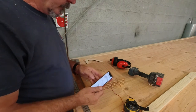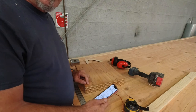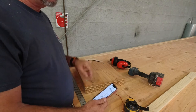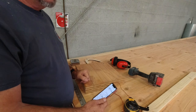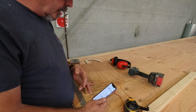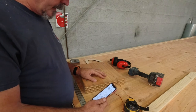So I feel like where the plywood goes between the root rib and the number one rib, and the tip rib and the number 10 rib, there should be a little bit of spar for that plywood to catch on the back side here. So I think what I'm going to do is split the difference.